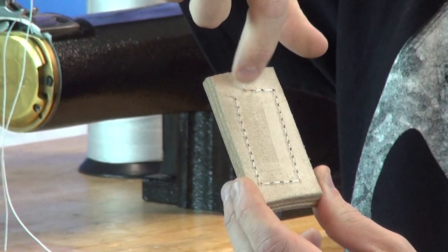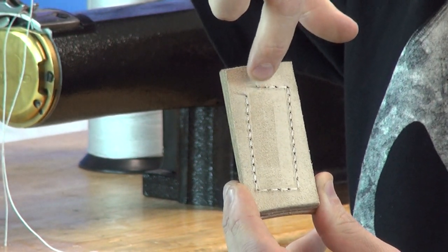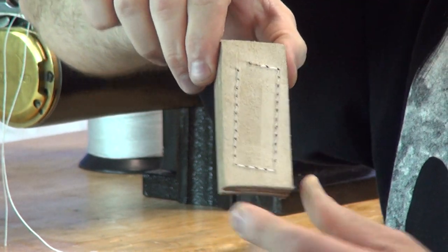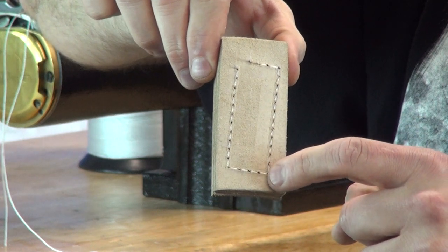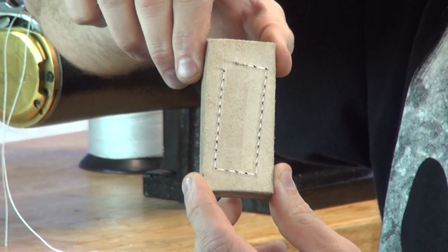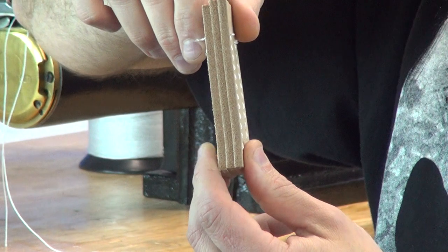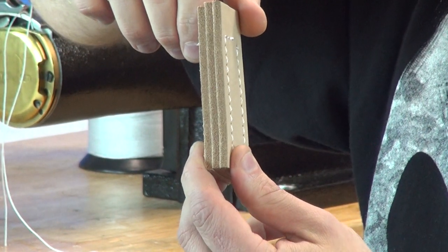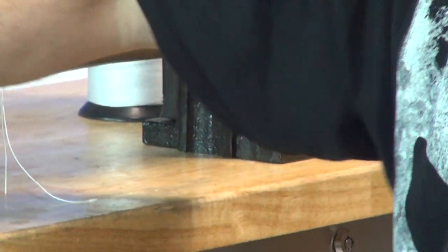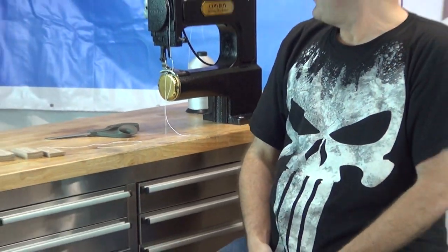Now I'll show the back of the material. This is where we started and where we cut the last stitch off on the backside, so if you see a little bit of loose threads there, that's why. Focus on this area — you can see the stitching looks extremely nice, it's extremely compact, and it's pulled the knots up into the bottom side of the material extremely well. This is approximately three layers of 8 to 10 ounce skirting leather or tooling leather, and the machine is quite capable of sewing heavy leathers with ease. The design of the machine makes it extremely efficient.